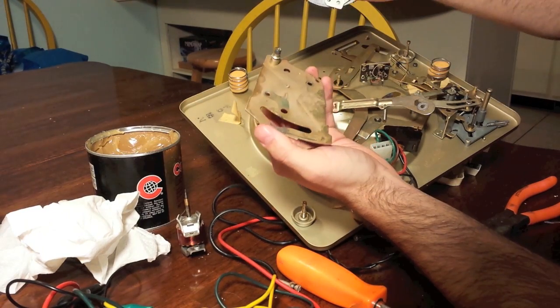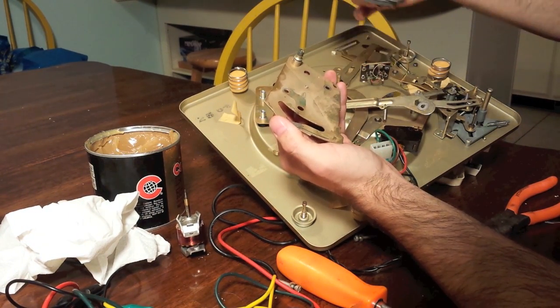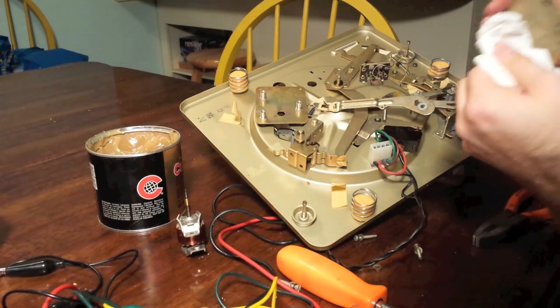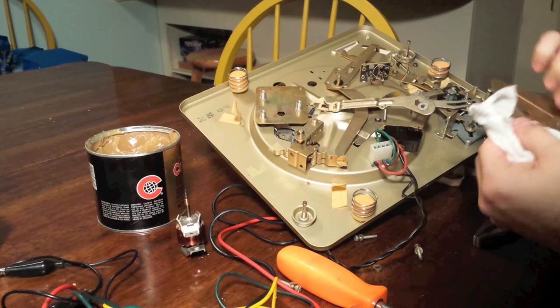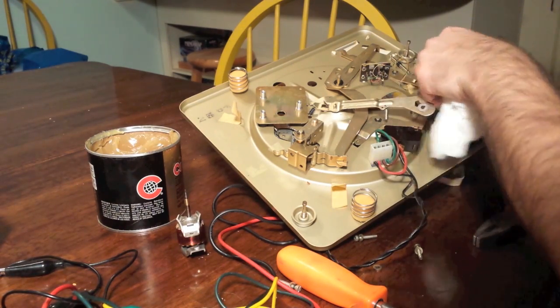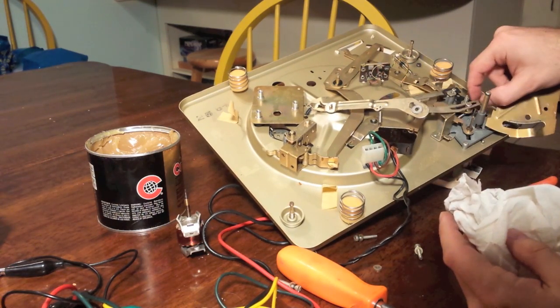Part of what was happening here was that this piece on a bearing was caught and wouldn't allow it to move at all. So I had to take off the snap ring that drives this hub, then remove the linkage. You can see all this grease back over here — we're going to remove it with a paper towel and make sure you get as much of it as you can, because it will affect the way this system works.